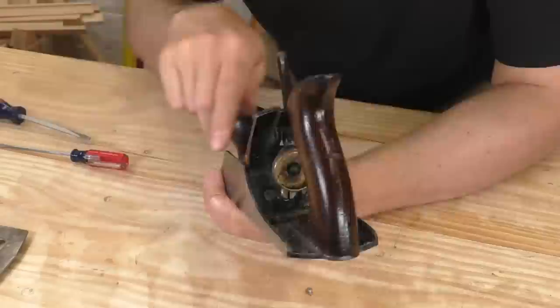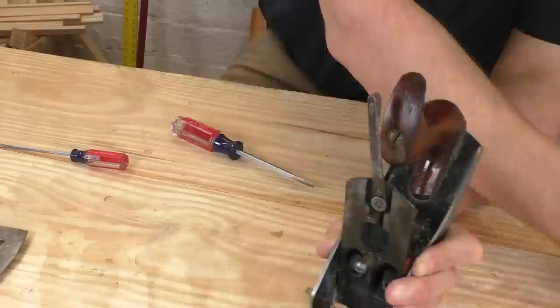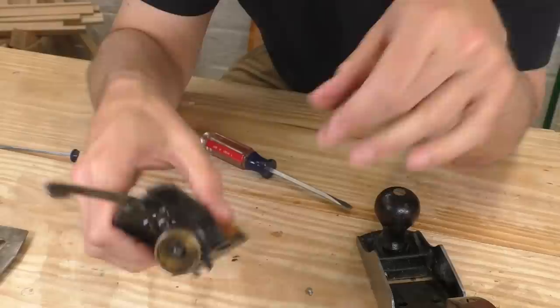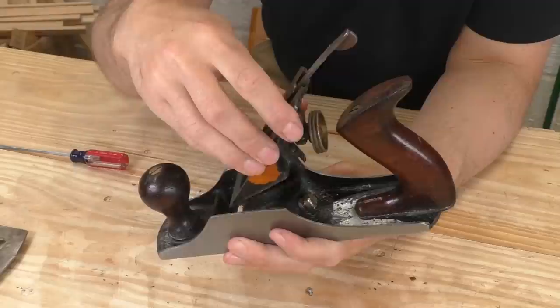The bedrock plane doesn't have screws — it has these two pins, and you unscrew the frog from behind. Those back screws have points at the end. When I look at the pins that hold the frog, they have little holes in them which fit those points. The pointed screw comes in and engages with the hole in the pin. As the screw is tightened, that pin is pulled down, and the frog is seated really tightly against the bed of the plane. Where the frog actually mounts to the bed of the plane, that's where we see the real differences in bedrock construction. On the bedrock, the base of the frog is a huge flat surface. The bed of the plane has another flat surface and little rails on the sides that hold the frog perfectly straight. The frog fits exactly to the plane body and it can't twist side to side at all — the connection is rock solid.